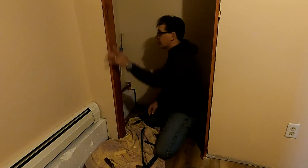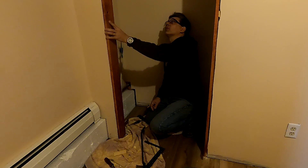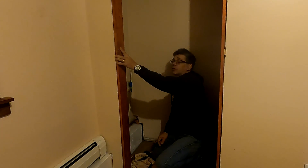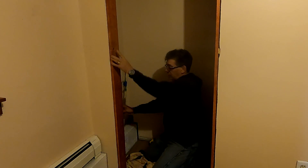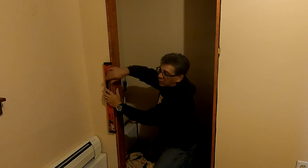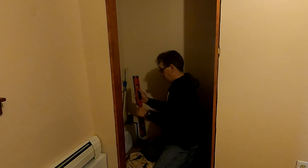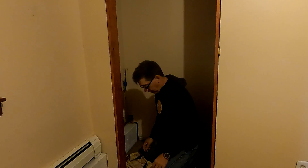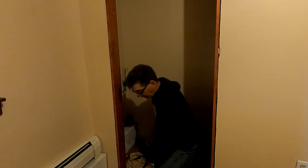Normally I'd also like to put a set in the middle because it helps take care of it — that's got a lot of movement to it. The truth is, once you put your face trim boards on and they tack into here and they tack into the wall, that will be gone. But I don't want it to get bowed before that.